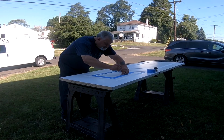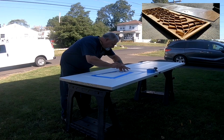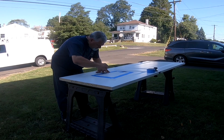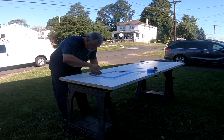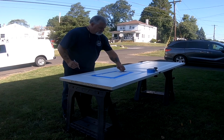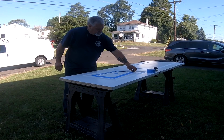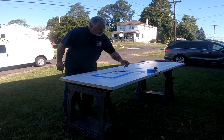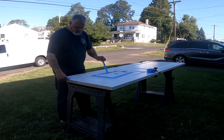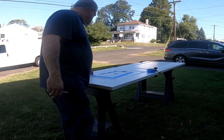Hollow core doors have corrugated cardboard glued on its edge between the front and back panel of the door. When you cut out the center of a hollow core door, sometimes it might feel weak between the two panels. It's a good idea before you tackle this project to have a table saw on hand and some scrap timber, so if you have to, you can rip down some wood real quick and just put it in there along the edge of your cut as a spacer to add strength back to the door.